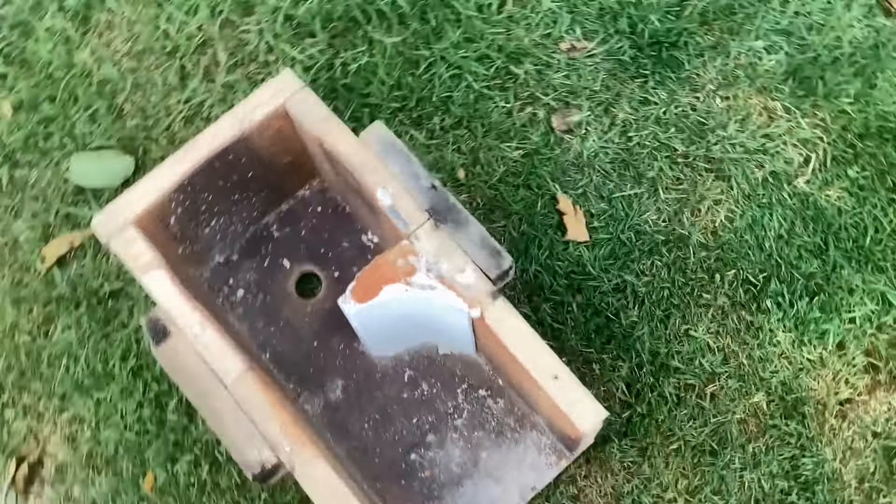I want to replace that with ceramic glass and give it a 15mm gap above the ceramic glass, then put the vermiculite on top. That will in effect give a secondary air flow above the burn tunnel, superheat the air, and hopefully it will go into the vortex at the top.